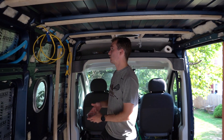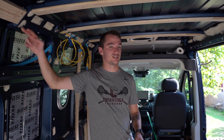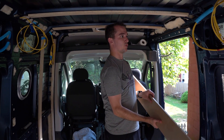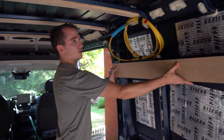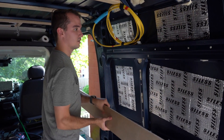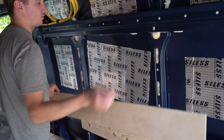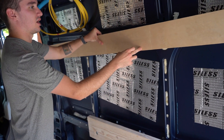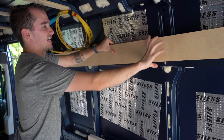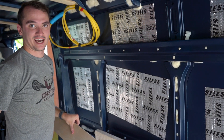We have put up some framing along the edges and these two vertical frames. I just cut out two boards that we are going to place horizontally. This gives us better support — whenever we put a board in here, we'll be able to screw into the bottom of this, and when we put a board up here, we'll screw into the top of this. There's an indent going over each lip of about an inch and a half or so.